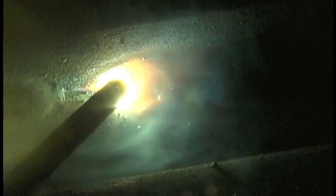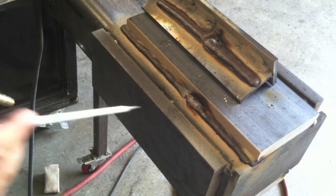I can actually feel the flux of the rod dragging along. It might make for another BB or two, but I just like it — sometimes I like to experiment with things like dig functions. What I'm doing here is going the opposite direction rather than making a tie-in that might look lumpy in the middle. I'm starting on the other side and welding to where I left off. I should have tapped the slag off that crater but I didn't, so you can see it gets a little squirrelly when it gets over that slag — but it worked out okay.